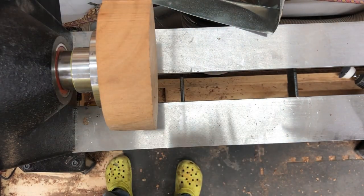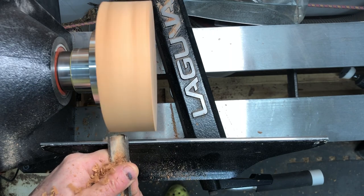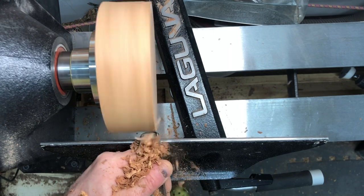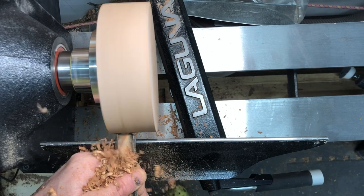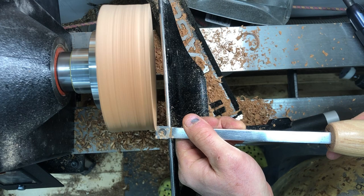One part of the bowl is a typical lighter edge grain mahogany color and the other part is a little bit darker while the bowl is turning, and that has to do with the orientation of the grain — I just made that decision on the fly. I've got to leave the two pieces I'm gluing up for the base of the bowl in the clamps for at least a half an hour, probably about an hour, until the glue cures. In the meantime, I've taken the third piece and mounted it using a standard faceplate on the lathe to start creating the lid.